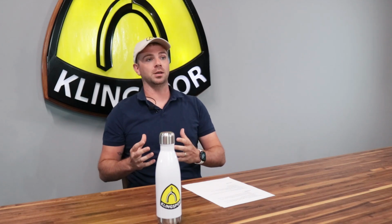So you've got your lubricant, which already gives it that 20% reduced heat. Then on top of that, you've got the vent that goes into it to keep your material cool. That's such a huge win, especially if we're working on stainless steel or aluminum. You need that product to stay cool, because if it heats up, it starts to melt, especially aluminum, where it glazes over. It's just nasty. So if we can keep that cool, we're doing really good.